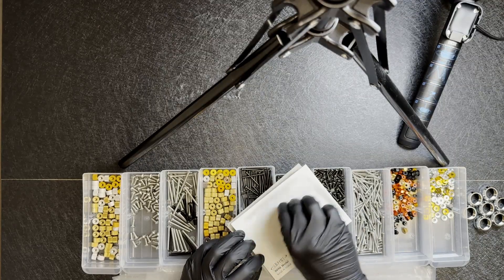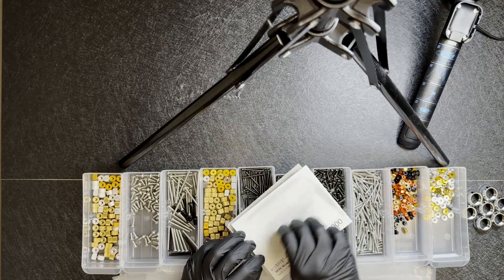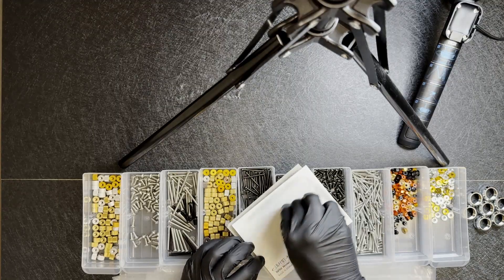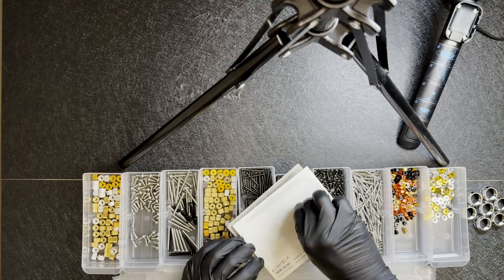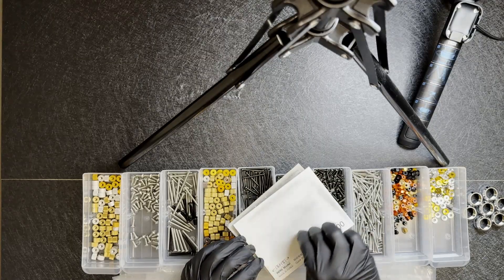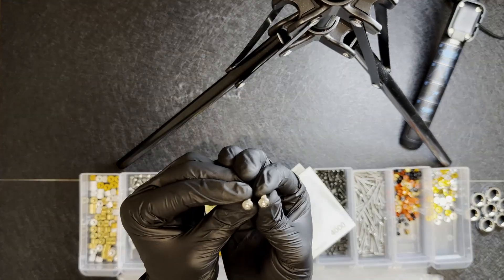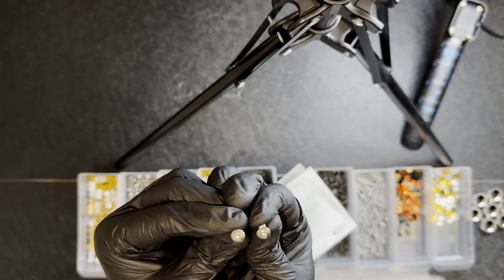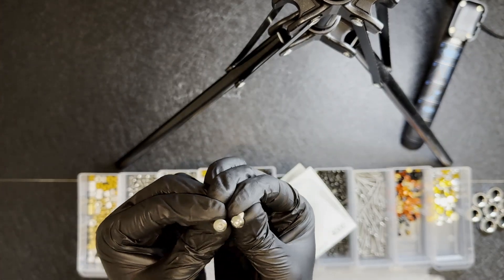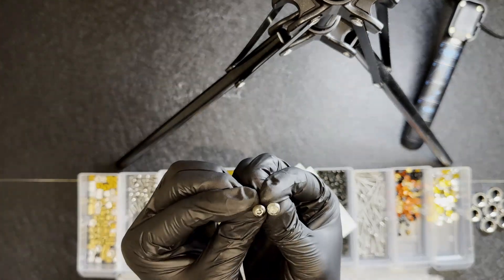If you're wondering why the shine is different: the 10.9 carbon is tempered — essentially hardened surfaces — so it behaves differently. The stainless steel has chromium in it, which is where the rust resistance comes from, and the light scatters differently on the surface. I'd love to show an animation of that but I don't have the editing skills yet — stay tuned, those are coming.